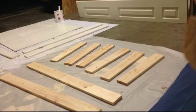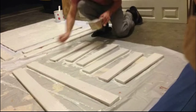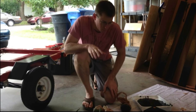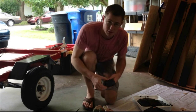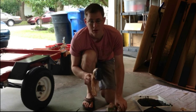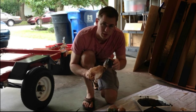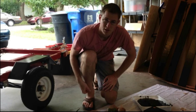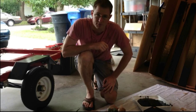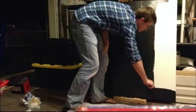One of the main reasons this project took so much longer than I thought was the painting, and there's probably a lot better way to do it — like hanging the boards up on hooks. If you don't want to clean up your roller at the end of the day but want to work on it another day, just wrap it in plastic like this — the brushes too. It'll stay good for days, sometimes weeks, and when you come back it'll be ready to go. It really saves you a lot of time, especially with oil-based paint. I gave all the wood two coats of primer front and back, then two coats of paint.